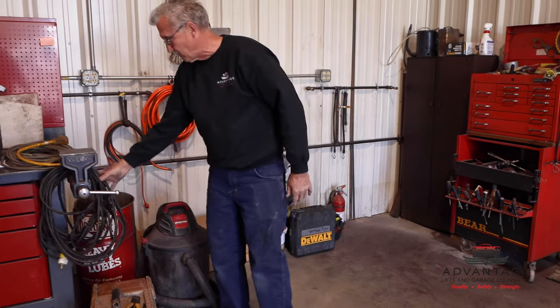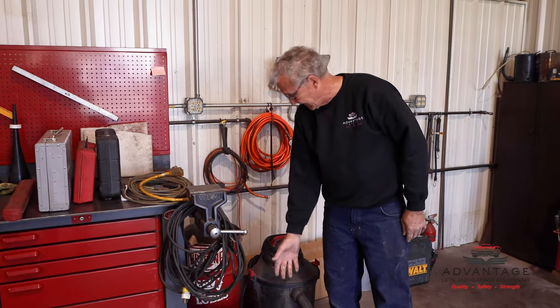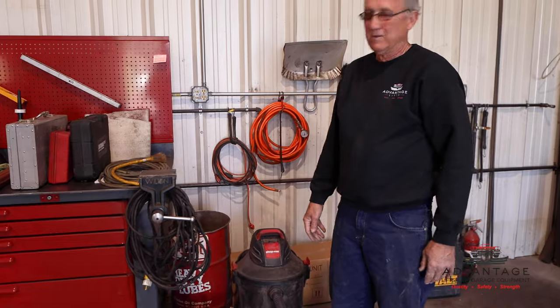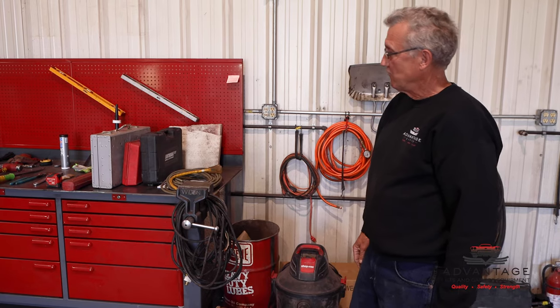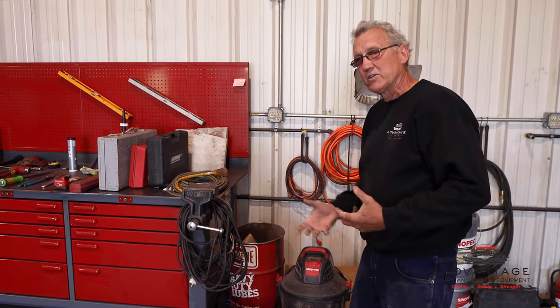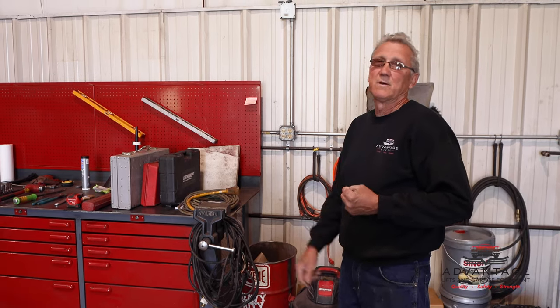I have an electric test wire for when we get done, so we can run a wire to run the lift. And I have a personal box that has miscellaneous electrical connectors in it, wire strippers, just to be able to hook up our test wire. On site, if we do the installation, we'll run a test to the lift so we can run, bleed, and adjust. But at the end, we will disconnect that. It will be up to you as a customer to either install the final wiring yourself or have someone come in and do it.